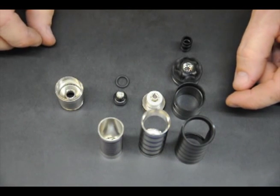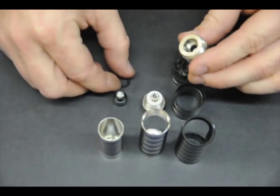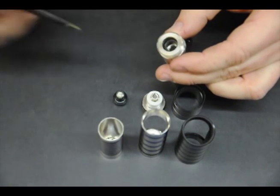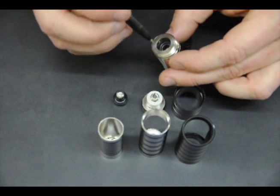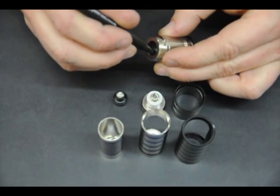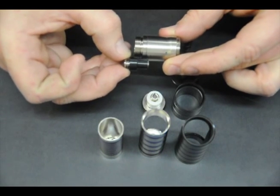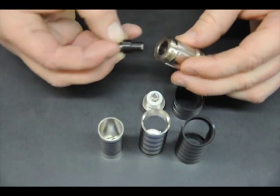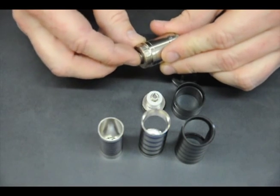So let's put it back together, going back the way we came with the thermocore interface piece. The thing to remember here with the switch O-ring is that it goes in and needs to be pushed all the way against the counterbore. In this lower end of the thermocore interface piece, you'll notice there's a counterbore, a shoulder on the inside, and then a through hole below that. It's real important that you get that O-ring all the way down against the base of that counterbore. The reason is that O-ring ultimately determines the final linear position of the switch — the shoulder rests against the O-ring, which rests against the counterbore. To put the switch in, just push it in, make sure it's all the way in. If you hear that click and it returns, your switch is functional.